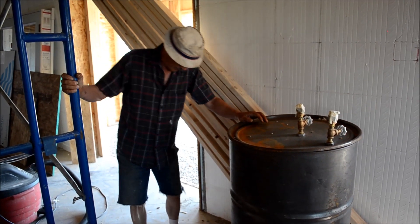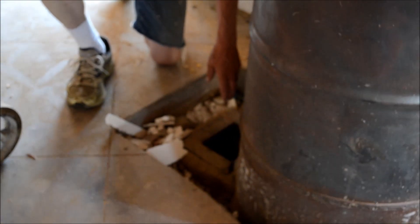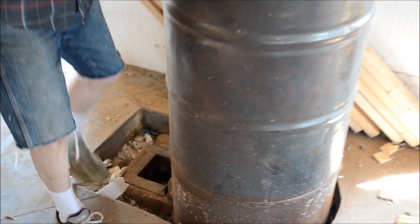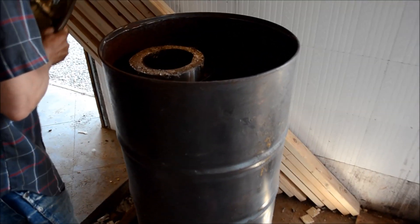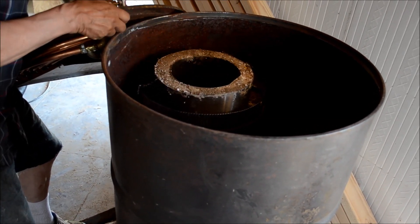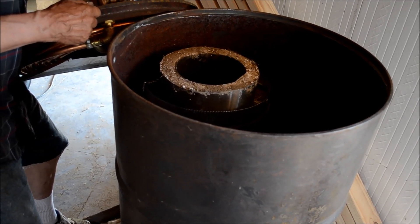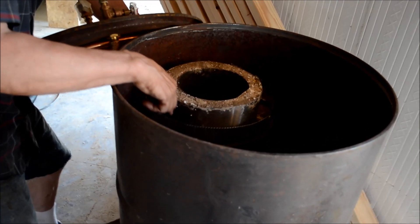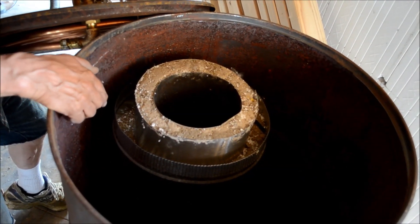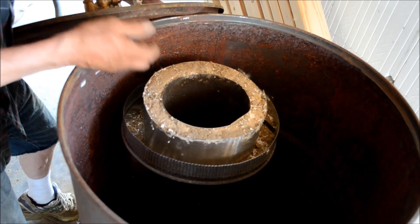This is where you put it in the fire, and it burns this way into the core of the barrel. The core burner is insulated on its first layer on the inside with vermiculite and bentonite — I use perlite, which is similar. The outside layer of this burner shield is sand and gravel for more thermal mass. That keeps the inside hot as you're burning, so it rises more.